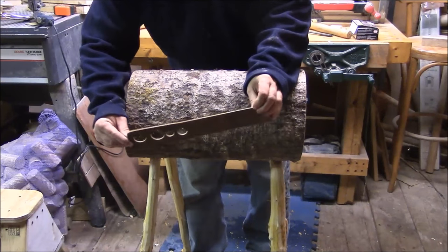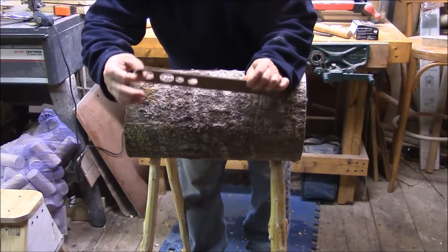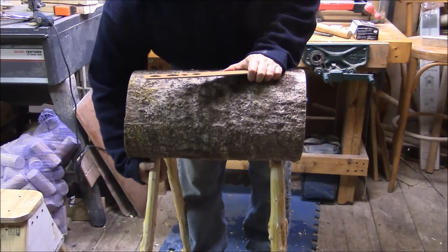So I just used a piece of scrap wood — this is one that I've used for other things — but the end hole is one inch. So I knew that if this would go around the top of the leg, I could put it in the hole and then pound it with the mallet and get it in there.